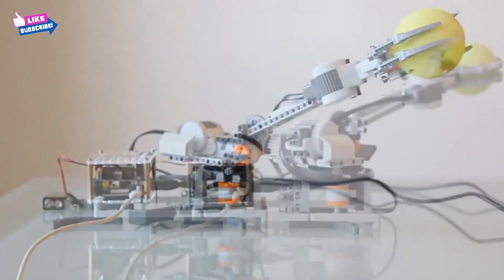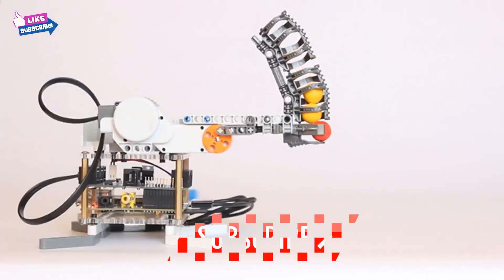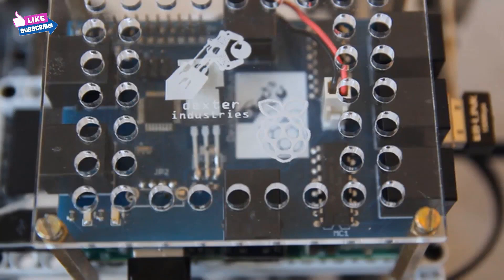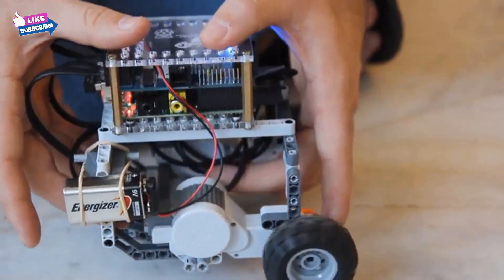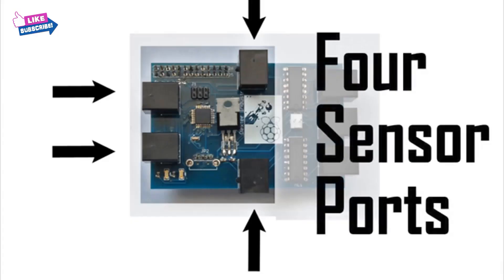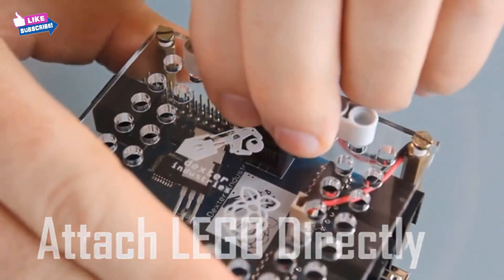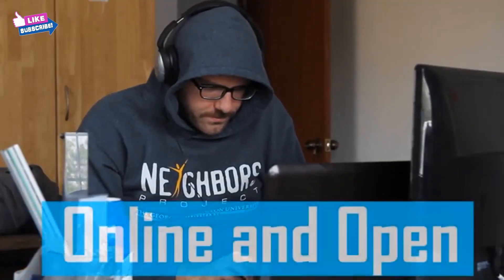If you can dream up a robot, you can snap it together. Lego makes building the robot easy, and the BrickPi unites these two systems together so anyone can make an awesome robot. The BrickPi has three motor ports that power standard Lego Mindstorm motors and read encoder values back. There are four sensor ports for connecting Lego Mindstorm sensors like the touch sensor, color sensor, and gyroscope. The BrickPi has two LEDs to add visual life to your robot. A 9-volt battery power source powers the motors, sensors, and Raspberry Pi, untethering the Pi from the wall socket. The motor ports and drivers are clustered together for maximum power delivery, and we've spaced the sensor ports around the front and sides for easy access. The pins on the BrickPi are left open on the top so you can stack more sensors and extensions onto your robot. We designed a sturdy case with holes that snap Legos in and can be used to build a robot around. The BrickPi is totally open source and totally hackable — firmware is simple and is written in Arduino, so modifying it is easy, and all designs for hardware and software are kept online and open.